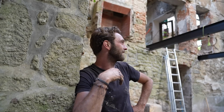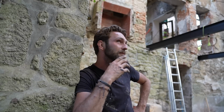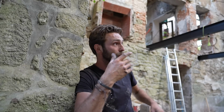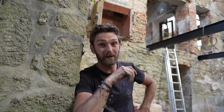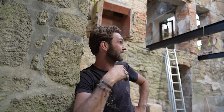Very roomy-esque, you know. So what I'm going to do tomorrow, now I know these are level, is get them cemented in and fixed really securely into the wall with a really, really hard mix. Then, could I pop to Brico tomorrow? I don't know exactly when, but then I've got to prep all the pockets for the beams, get some templates drawn up of how they fit into the I-beam, and then put the beams in. So I reckon a couple of days and a lot of these beams will be in. Maybe I'll go get them tomorrow, maybe it'll be the day after. There's a lot to do. Yeah, there's like 30 beams or something to put in. But this is exciting and I'll see you for beamy stuff tomorrow.